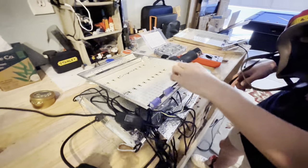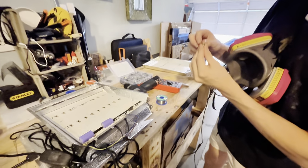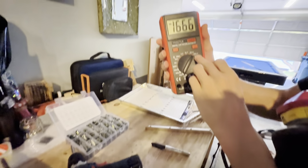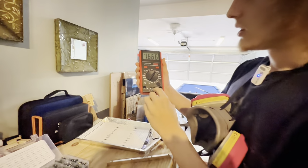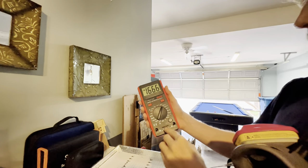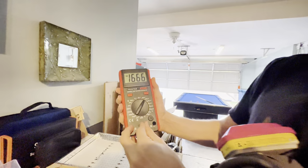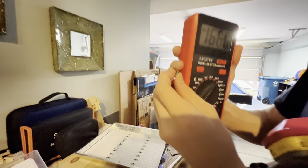It's best to disconnect them completely and test them individually, not test them on there, from what I know. So, like I said, they're typically labeled, but here's how you know it's failing. We're gonna rip it right off. And then we see we got the negative and positive, and we got our LCR tester. So we're gonna set it to 2000 microfarad, so that's within the range, because 200 microfarad won't be able to reach 470. You can use connecting leads if you want, or you can stick it right into here, which is why I like this one too. Not all of them have that. The leads may be too short, because they're really tiny.